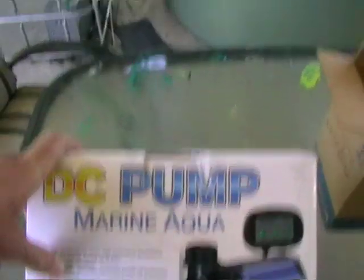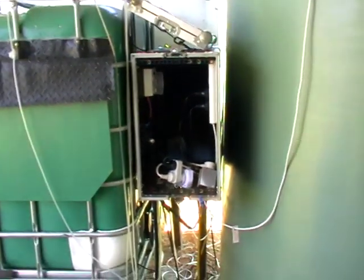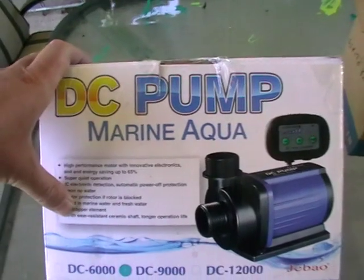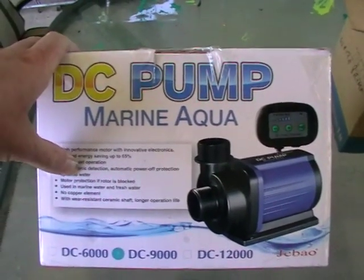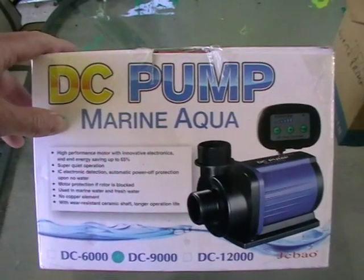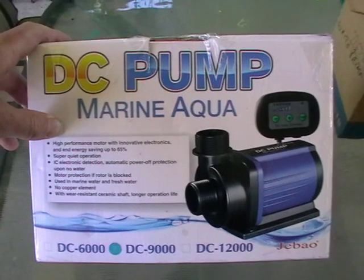The tanks I use at the moment run off a lot of solar. You can probably see inverters, solar controllers, pumps and all sorts of stuff in that little box there. I wanted a DC pump because the AC pumps I've got need too much of a kick to start them. Once they were running they'd be okay on the solar, but a DC pump is the go for solar. I'll do another review on it actually working on the solar.